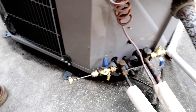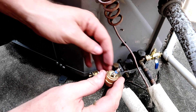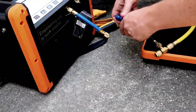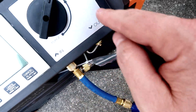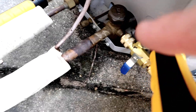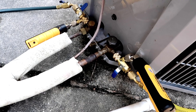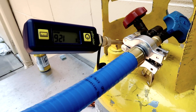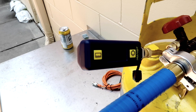That's the core — pull that with the core remover tool. I just leave the core on the core remover and set it like this on top of the condenser so it doesn't get lost. The direction of flow is this direction, so we want to point that in. Cores are removed. I have probes connected on the ports just in case I want to see the pressure. Once we're done, we've got to pull a vacuum on it, so that's really what we need those ports for — for our micron gauges. We've got a nice deep vacuum now, so we're ready to use this tank. You'll notice it does start to creep up just a little bit — we're at 127 now, but it's nice and dry.